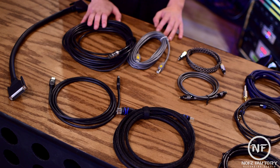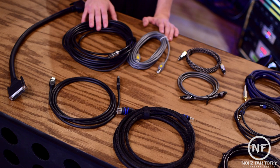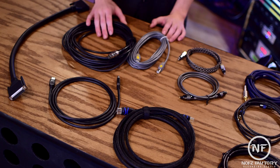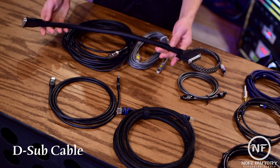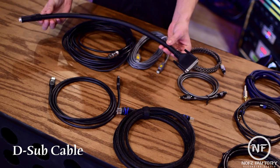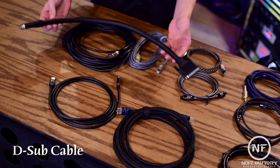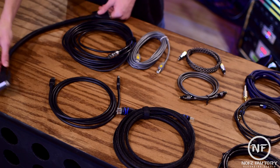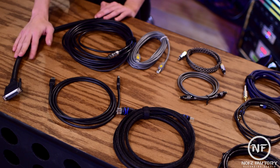Let's move on to digital audio connectors, which are required for linking digital mixers, recorders, preamps, and DAWs — digital audio workstations. The first type is the DB25, or D-sub cable, also known as the TDIF cable. It can both send and receive up to 8 channels of information with a single cable. This is outdated technology, and most people have upgraded to USB and MIDI cables.